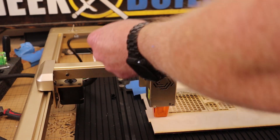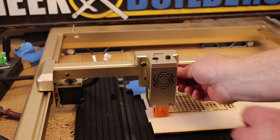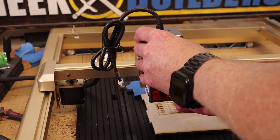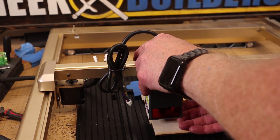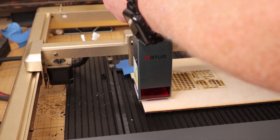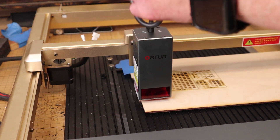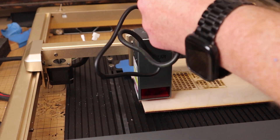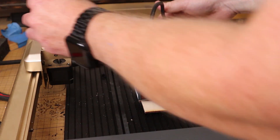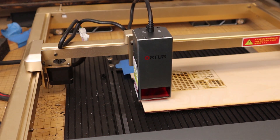The modules are really easy to swap out. Simply unplug the pre-existing cables, remove the 10-watt or previous module, and slide on the new one. Use the new thumbscrew, connect the new power — that's all contained in a single cable, just like the previous one, which makes it really nice. Make sure you connect it to the right port, labeled L. Do some cable management later and we're almost ready to go.